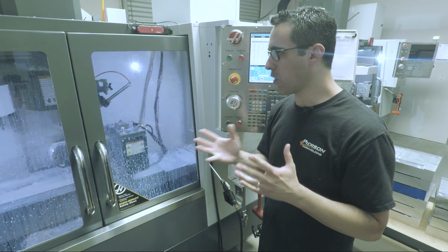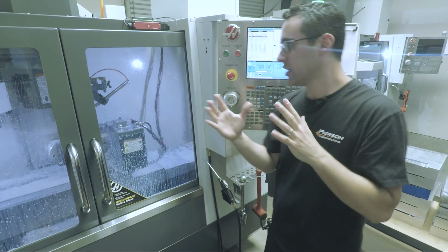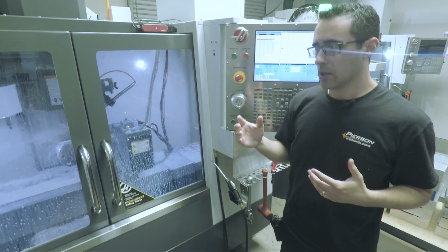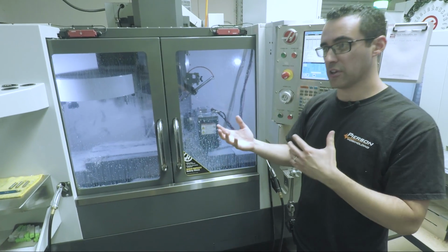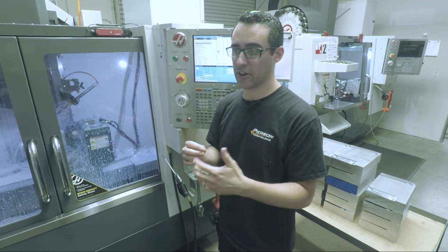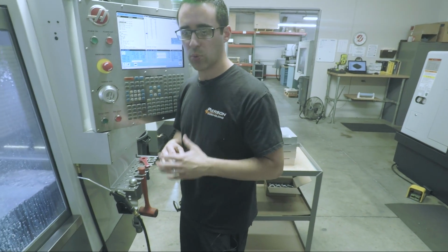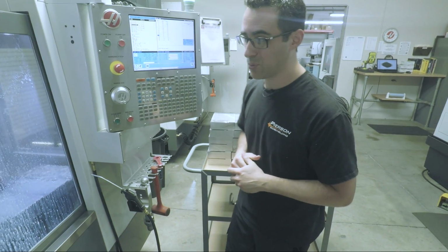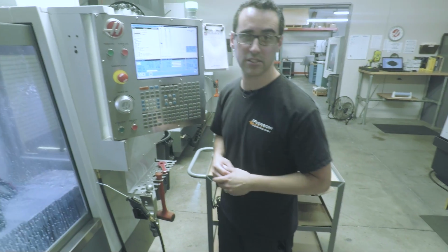Yep. Up to maybe 1 thou per side of the thread, like 1, 2, 3, 4 thou. So there's some formula there. What if a supplier doesn't have the right fittings that go into it, and now another supplier sells it with slightly bigger diameter? Got it. Or one supplier doesn't sell it with pipe tape on it. So we just standardize with the thread gauges, and quite frankly, we won't use that supplier if they're giving us different fittings. So.